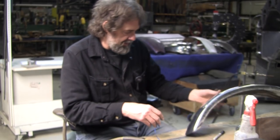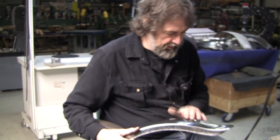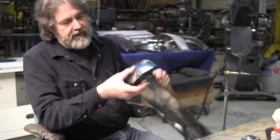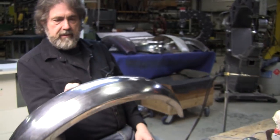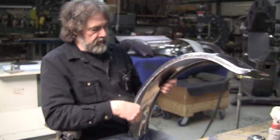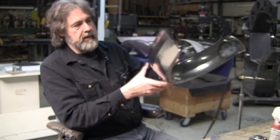So there we are, it won't balance anymore, so we got a point in the front. So we got both ends finished off pretty nicely. We got that fading out, nice little peak. Got a bobbed back, we got the nice ducktail going on here, and we have a nice point on the front. It's looking really nice. So next step, we'll put the side pieces on. Maybe put a bead or a joggle, and then we'll reinforce that edge. And I think we'll call it a day at the end of that. And that should be the next video.